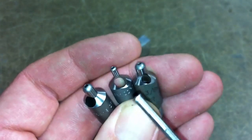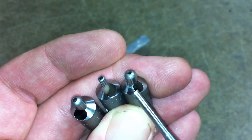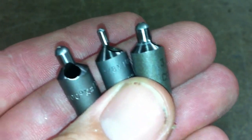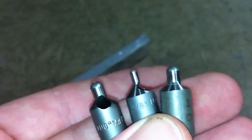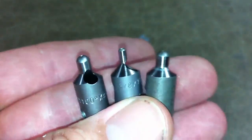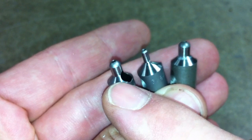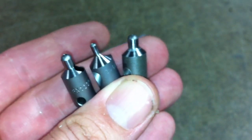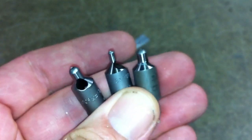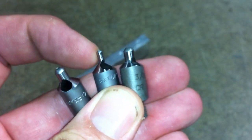What I have here is single flute cutters. Single flute cutters are sometimes called high hook cutters. These cutters have a single cutting flute, created by a hole drilled kitty corner through the countersink itself. If you look at it from the end, you can see they're shaped on kind of a conical machine, so only the cutter area — the very edge cutting on the aluminum — is touching the edge of the hole. As it rotates, it peels off that chip creating a really nice smooth countersink, because it's always touching the material in one spot. The conical shape tends to hold it really well in the center, and of course the pilot is what keeps it centered in the hole.